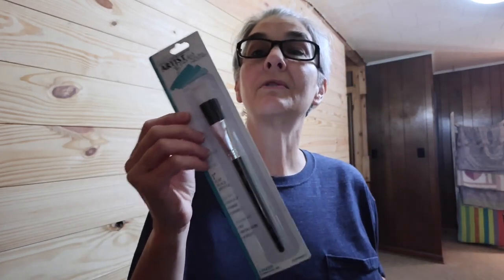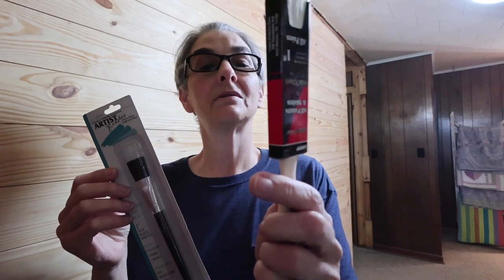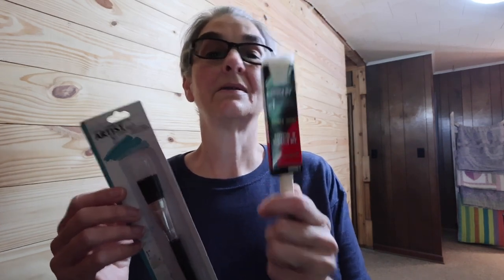To actually apply the stain I'm using a brush from my craft room — about ten to twelve dollars — and I'll be wiping it off with an old towel, because once you put it on you wipe it off to get the look you want. I also got some smaller brushes for the crevices, but the tongue and groove gaps are so tight I may not need them. If you have shiplap you want to stain, a small artist brush or a small stain brush works well for getting in between.